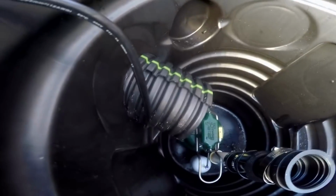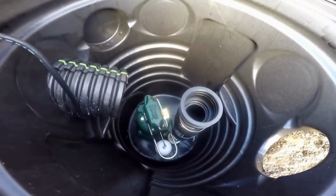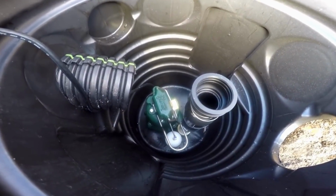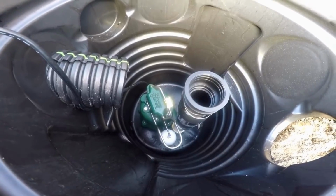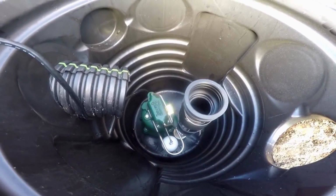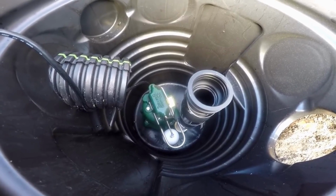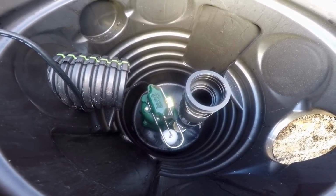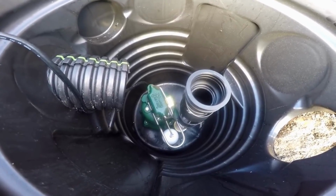Remember, this side is the French drain. This pump will handle all of that, no problem. This pump pumps between 60 and 80 gallons a minute, depending on the head, which means how far and high it's pushing it. Because we're pushing it about 150 feet, it's probably only going to pump about 45 to 50 gallons a minute. More than enough. I mean, that's a trash can and a half full of water every minute that comes out of this pump.